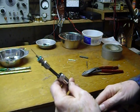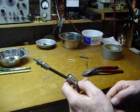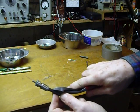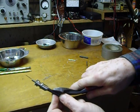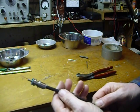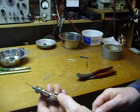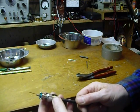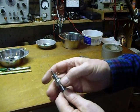You can also put these connectors on RG-11 with aluminum — you have to nibble off a little bit of the outer insulation near the edge to make it small enough to screw in, but PL-259 connectors work on RG-11 too. So that's how to put your connector onto RG-6 with aluminum braid and shield. That's it guys — 73s and good DX.